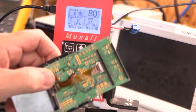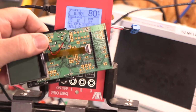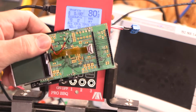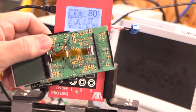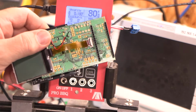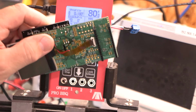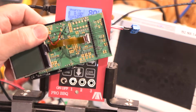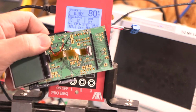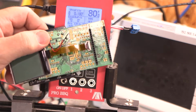So one of the things I forgot to mention is before I put the button panel on here, I just plugged in one of the newer ESP32s on here and tested it on the scope. It made a good ACK, a relatively good ACK. It worked, and then as soon as I put the button panel on, it stopped working. And I said, "Aha, we've got a capacitance problem on the I2C line, on the SDA line."